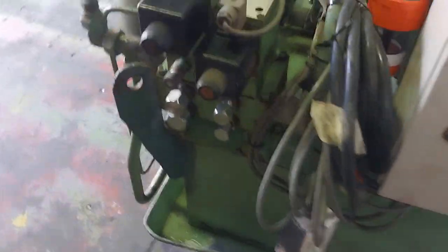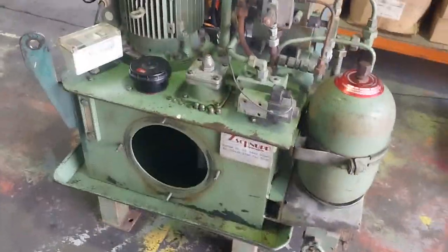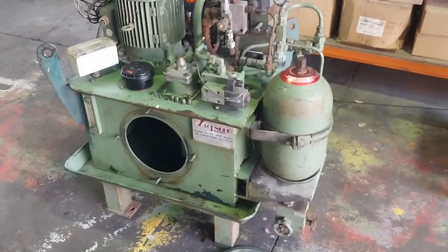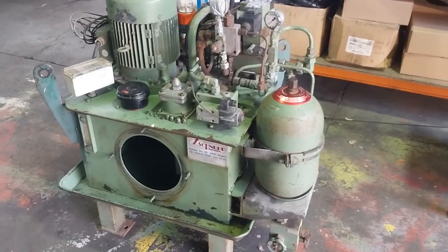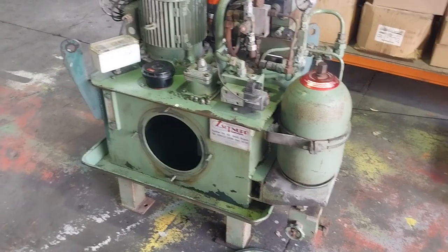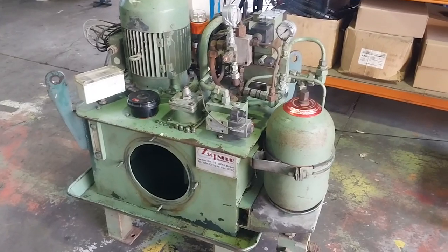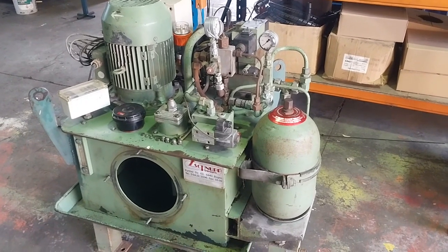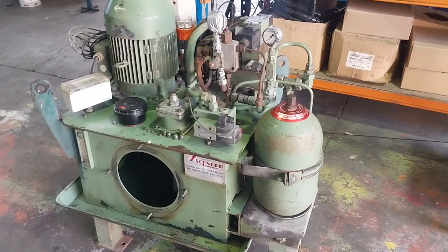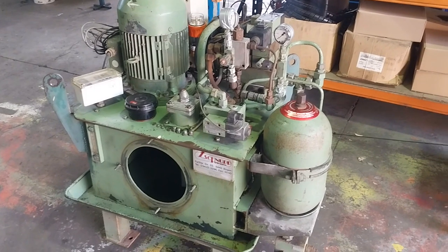So that's the system. It looks to have been made in Germany at some point. Potentially this could have been used — we see these type of power packs in high-rise buildings for raising formwork as they move up a level. This may have been purpose-made specifically for the special effects industry, or it's been repurposed from some other industrial application. When you first look at it, it looks really complex, but with hydraulics — like any electrical or hydraulic drawing — you just break it down into its individual components and then it's not so scary.